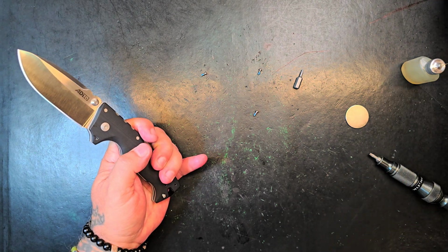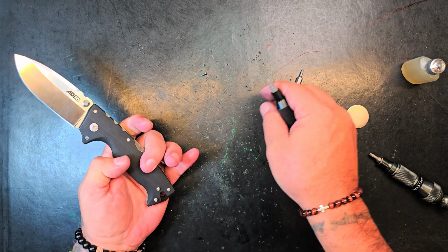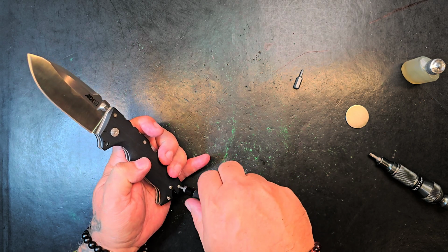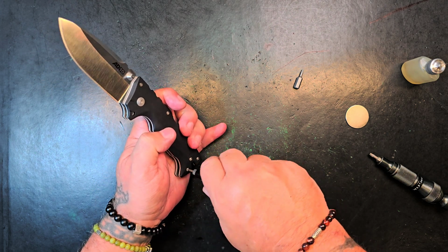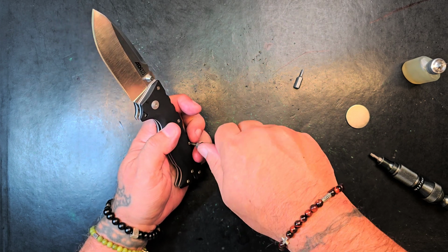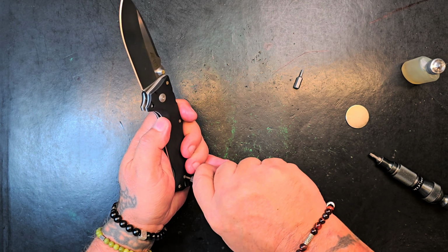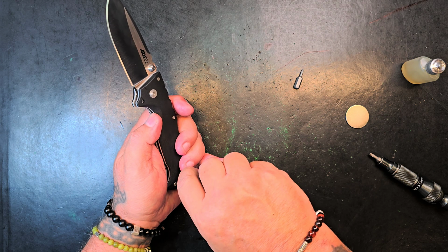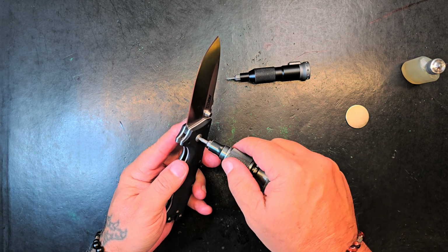Let's get some T6s in. They're all the same size. I'm going to actually tighten up the back part first. Get this snug down. Kind of like a Spyderco. You know, work in progression to manage the tension on that washer action. And a final check on the pivot.